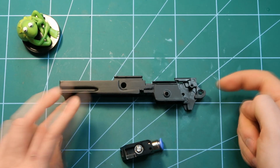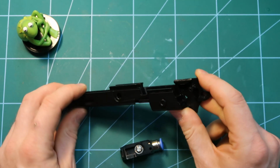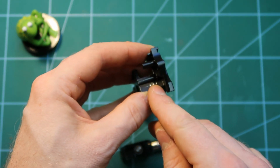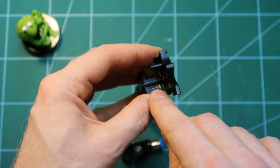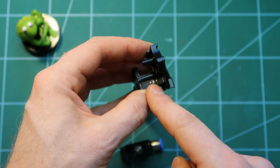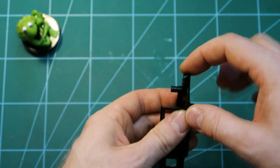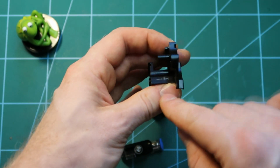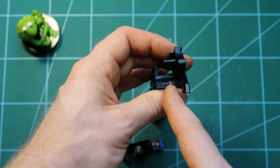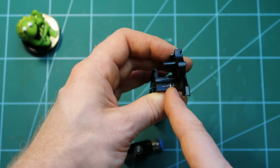Right now we need to take a drill and drill perpendicularly to this wall through the points where we marked the screws should be. So these side crossings, of the vertical and horizontal lines, and the middle can stay. There is no screw in the middle. It was just for reference. And the access could be a little tricky because you can see that you run very close to this wall here. So maybe you have to drill the inner hole at a little angle, but this will not generate any issue. You can just drill it, it will be fine.